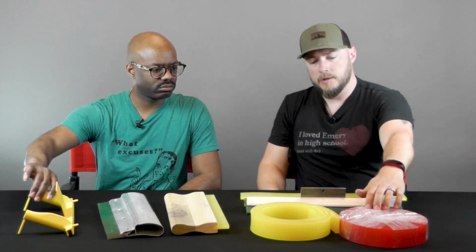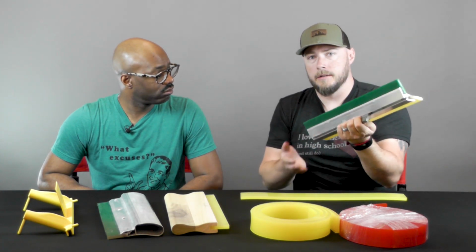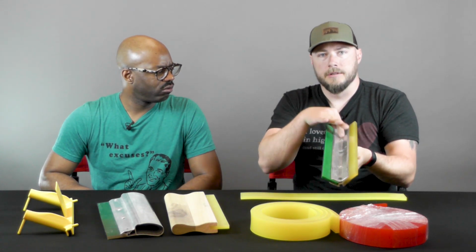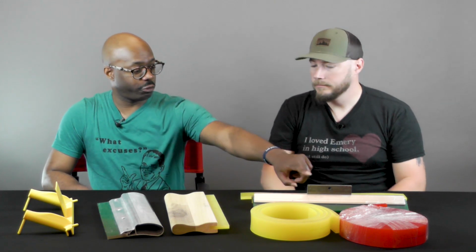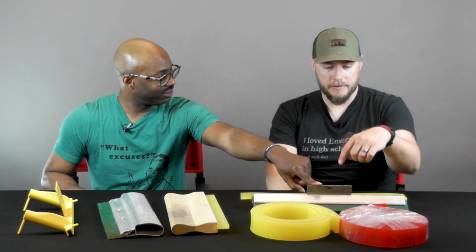You can also use the squeegee frame, or the squeegee rolls, for different types of automatic squeegee holders. Okay. So this is just a rotating one. They have the chopper system as well, which is more of an up and down motion than a rotating. Oh, okay. And so with the same method, you can just pop your screws, slide them in and out, and change whatever durometer you want based on your roll purchase. Cool, cool. So this is for the robotic. That's for the robotic one. All right. Automatic, right? You got it, man. For the robot. All right.